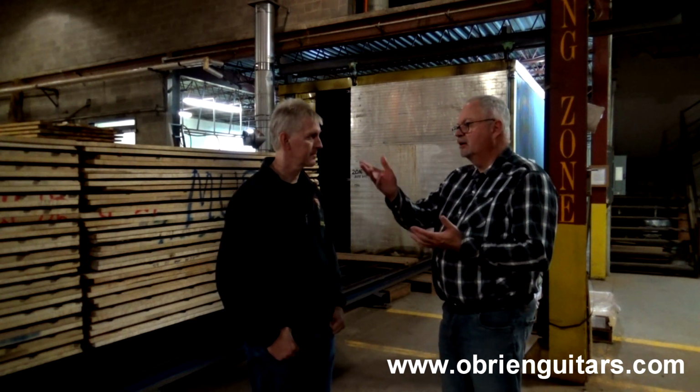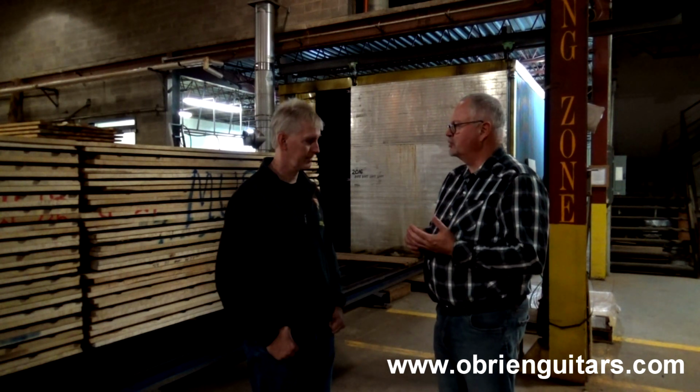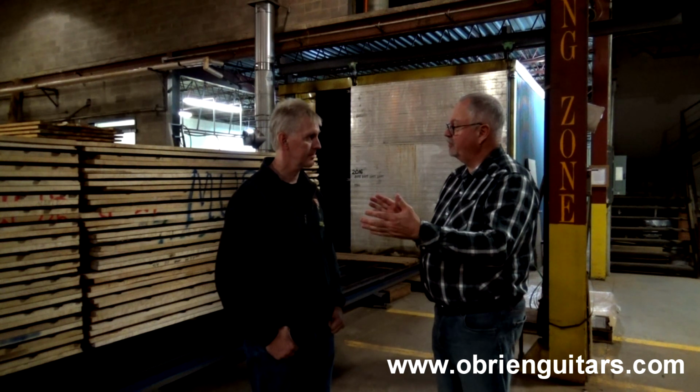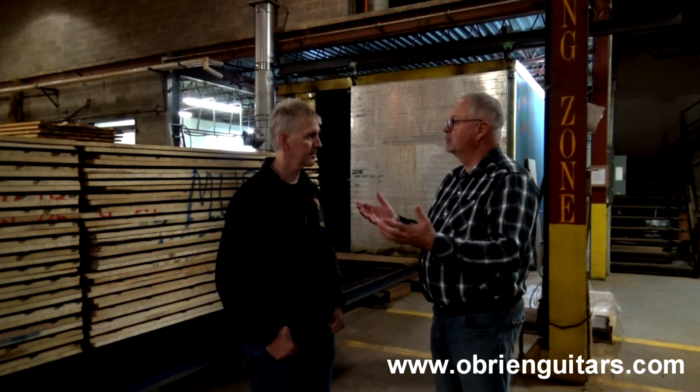So what we do is that Dale's wood will come in at anywhere between 8 to 10% moisture. We'll take it from that number and we'll bring it to zero. So that's the drying phase. And we probably dry at double the temperature that you would in a conventional kiln.